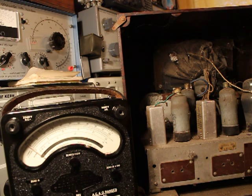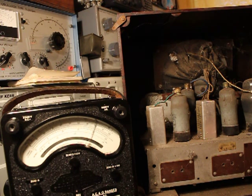I'm going to see if we've got connections through to the filter caps — or the smoothers. Hopefully you might see this needle. The switch seems quite positive, so let's switch it off. Let's see if the filter caps charge up across the mains lead. And we've got a connection through the transformer as well. There we go — that's falling. Switch off. Good. Well that's positive.